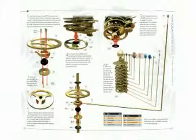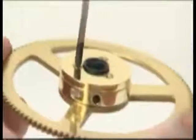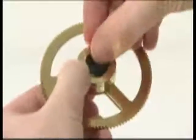The tenth phase of stage 2 adds dwarf planet Eris using components supplied with issues 46 to 47. In this phase, the large gear sandwich has only a 106 tooth gear. Eris is the last in the chain, so a blank gear completes the assembly. Place a plastic washer above and below the large gear sandwich on the central column.